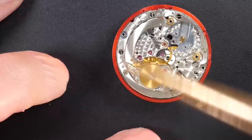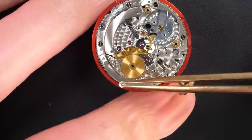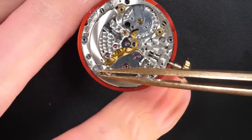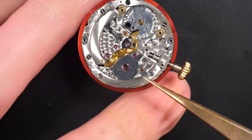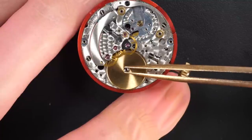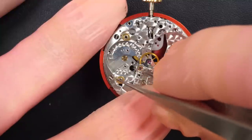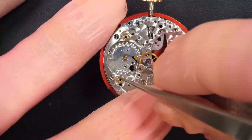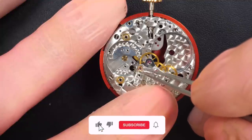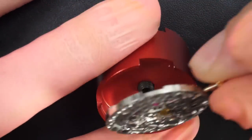Removing the clip — there's a little spring underneath. I love this ratchet wheel from Rolex, with that golden type of finish on top. Again you see the jewels underneath — jewels with the barrel arbor, jewels everywhere. That's what makes these Rolex calibers so solid. Even though this one is broken, it could be due to wrong use, but it should be fixable.